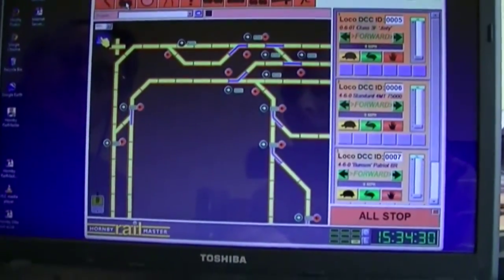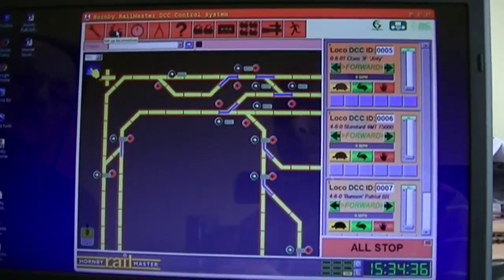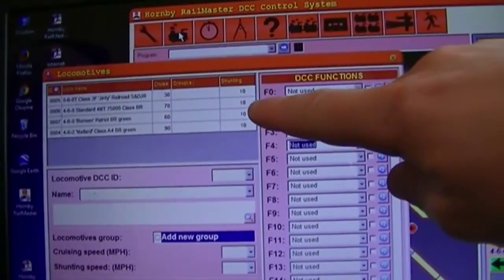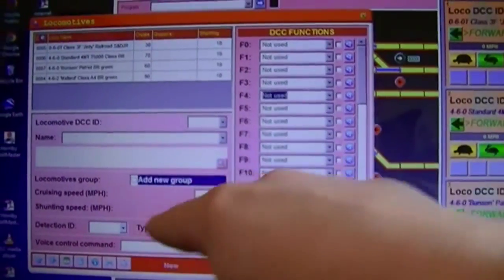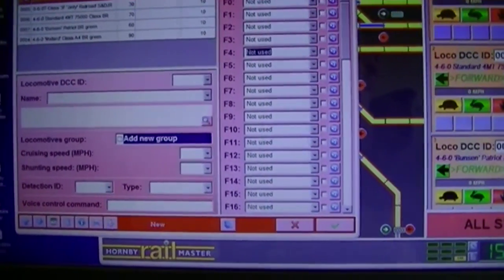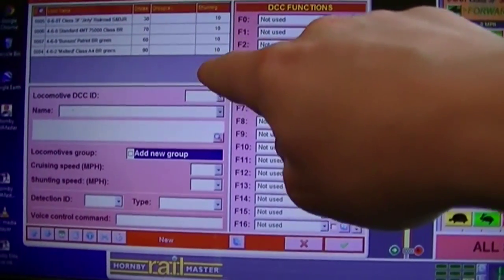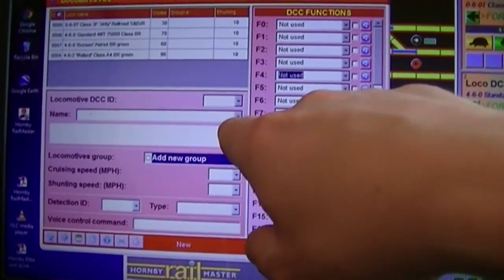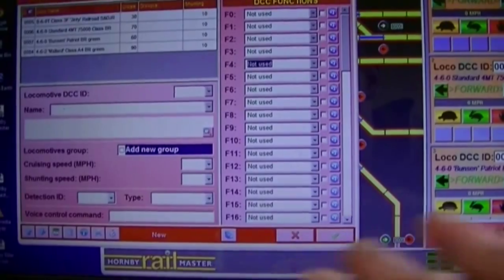The second icon in on the main menu is for setting up the locomotives. This brings up our list of trains we've already set up. We haven't done much with that yet, and this section is for adding new locomotives. Because we're doing programming, we're going to program the chip first, then set it up on the list. That way we can put in the locomotive ID straight away, add the train config, hit save, and it's added to the list — a much simpler workflow.